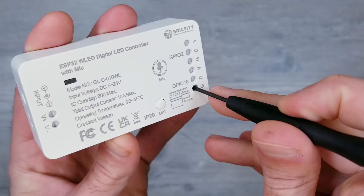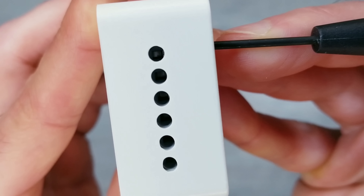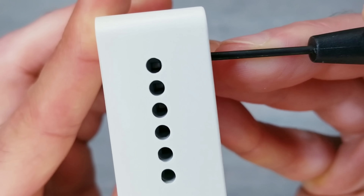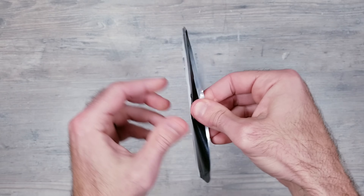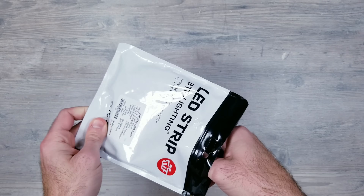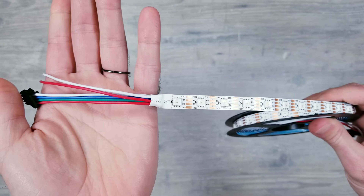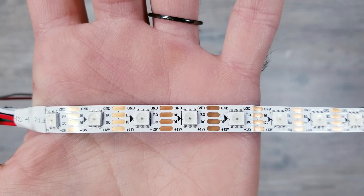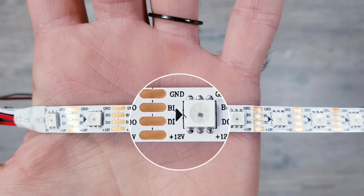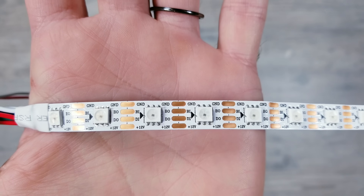They're using push-type connectors — as I'm pressing down on top, you can get a glimpse of the little window opening and closing, which is where the wires will be placed. Starting with the 12-volt WS2815 LEDs from BTF Lighting, these are very similar to the 5-volt WS2812B strips, but being 12-volt, if you're doing a big project you won't have to have as many power injection points. The strip also offers an additional backup data line, along with the normal ground, regular data, and voltage. Little black arrows indicate the direction data is flowing, which always has to be going away from the controller.